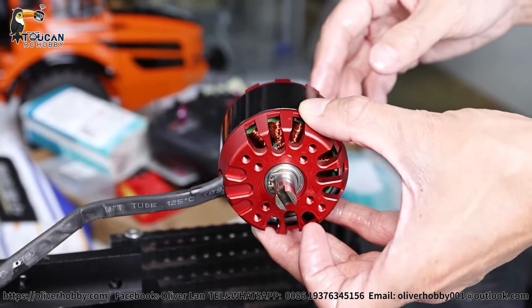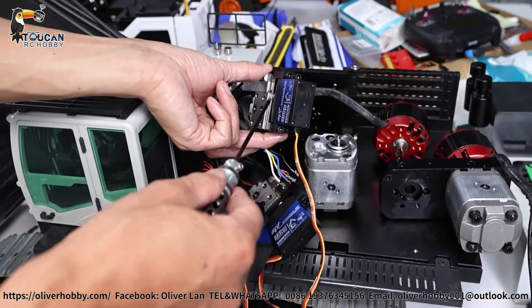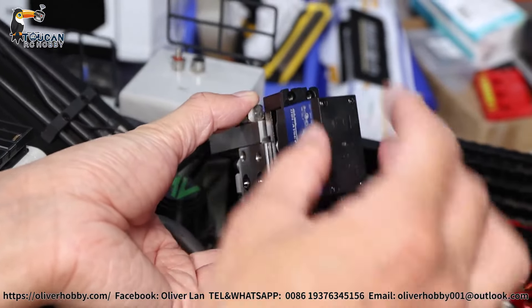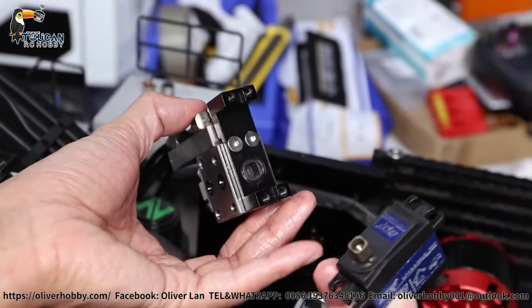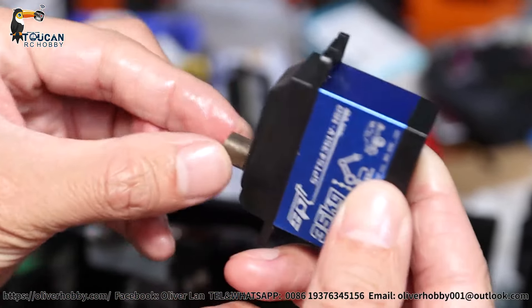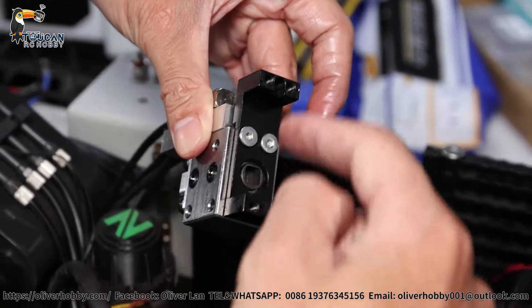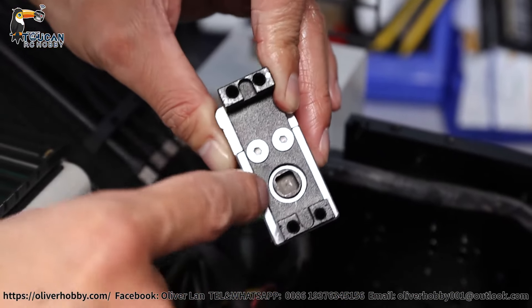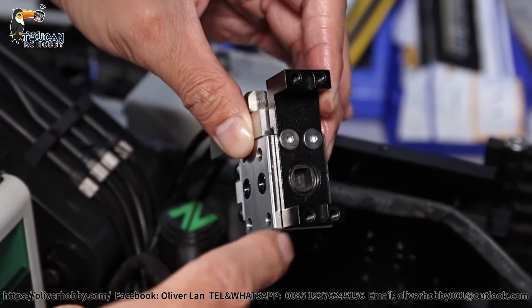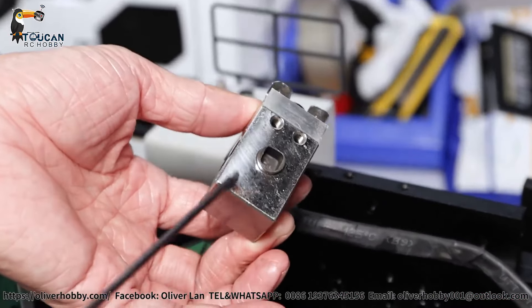We will see how the pump assembly looks. This side is for the rear pump connection and forward pump connection. The two screws in the middle — that's the oil outlet supply, the middle oil supply. I also removed the four fans and the wires that were going to the main connection power supply so you can see more clearly. The middle connection block on this side for pump connection has the oil channel in the middle, but the oil channel coming out from this side is not in the middle. That's the oil discharge for rear and forward pumps. That's the pump seal with this block.